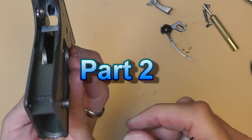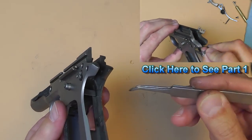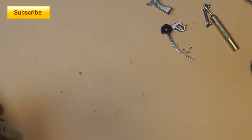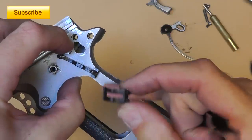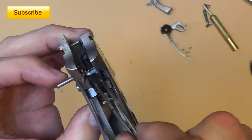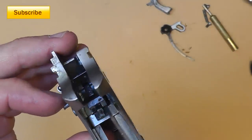Now that we've got our trigger bow in, we need to test to make sure we didn't bend it too much, so we have to put the gun back together including the Series 80 parts. First, we'll take the pin that fits in this hole and get it set up. Then grab the sear and disconnector — notice the disconnector with the little round part at the top — set the sear right on top, grab it by the disconnector, stick it in the hole, back out the pin a little, slide it in and wiggle it.